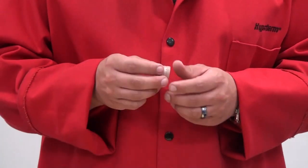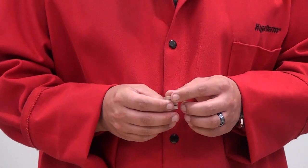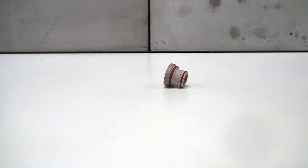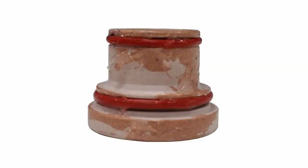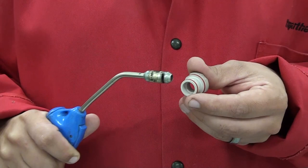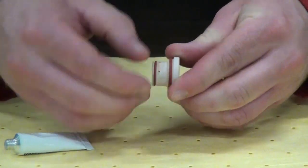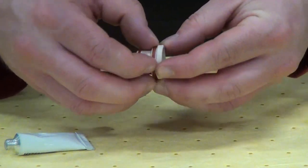Next, the swirl ring is responsible for directing and metering of gas flow. Commonly, the swirl ring is damaged due to incorrect installation, being dropped, or incorrectly lubricated. When inspecting the swirl ring, look for chips, cracks, blocked gas holes, and missing or damaged O-rings. If any of these examples are found, replace the swirl ring. Dirt or debris can be removed using compressed air. O-rings should be lubricated properly and no excessive lubrication should be blocking gas holes.